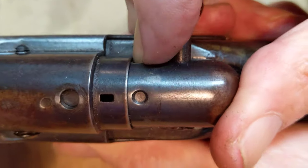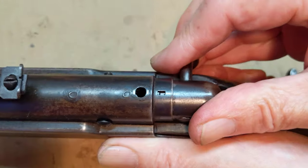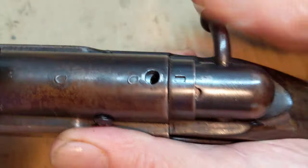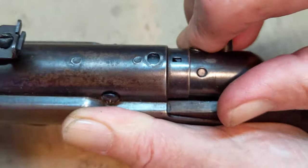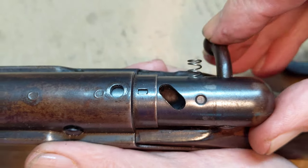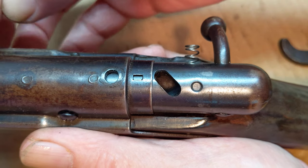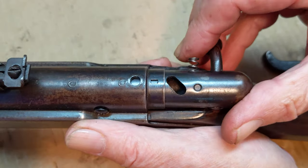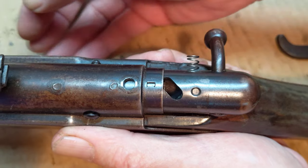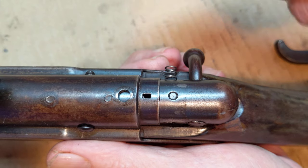Now when we get to this point, you've got to compress the spring and kind of elbow it in there - it doesn't want to go, but it will. And then you'll notice there's a slot here at the top. The slot at the top is important because it allows this bolt to spin. It's a very narrow slot cut at an angle. So when the lever engages the plunger assembly and the plunger assembly pushes back against the very tip of this bolt, it will push the bolt up. When you cock the lever forward and put the plunger assembly in the firing position, you'll be able to freely push this forward and drop it down, which will open up the slot, allow the trigger to function, and the gun will fire.